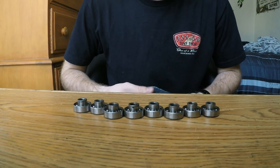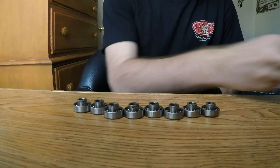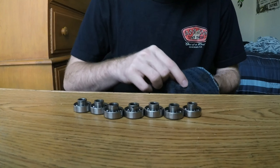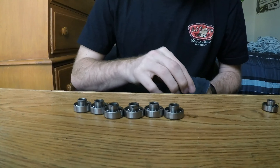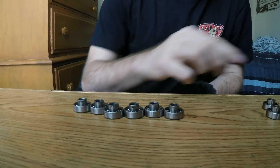Now that you've got your bearings all covered with the speed cream, take a cloth and just pat it — don't rub it, because that'll take off all the speed cream. You just want to tap and dab it so it doesn't wipe it all off. The cream can bleed through onto the table, so just go through and carefully wipe them off.